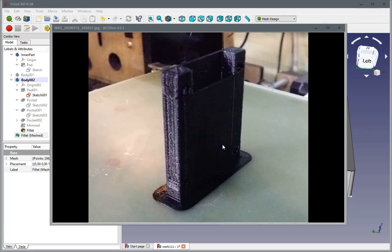So after a while the print has finished, and here we can see how it's coming out of the printer. By the way, I'm using a plain A8 printer — I've got that thing since three years and it works pretty well. This one is printed in PLA, and my print bed is a heated print bed using an FR4 copper-clad material — that's a fiberglass epoxy material, the one you use in electronic circuits. And I'm printing on the epoxy side, and that works very good for my PLA printing.